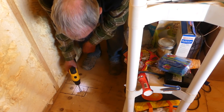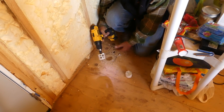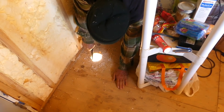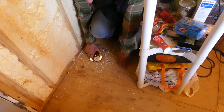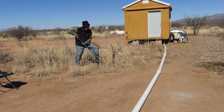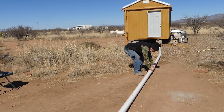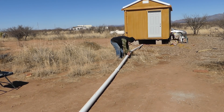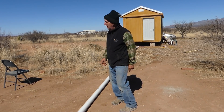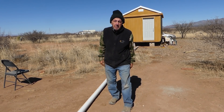I used a variety of tools to make the hole in the floor. The first hole I made was out of alignment so I did another one. Now the PVC pipe can enter the floor with ease. Next I got rid of a cholla cactus that was in the road — nothing I want to encounter while laying pipe. Now I'm lining up the pipe to travel a direct line from the panels to the cabin. I'll research whether I need to glue this, but for now all the solar wire is safe in the PVC, which is a good thing.